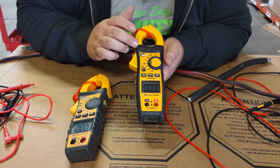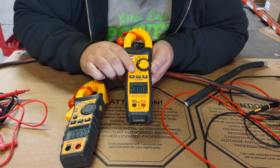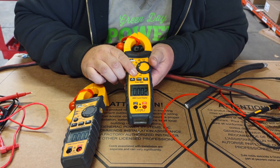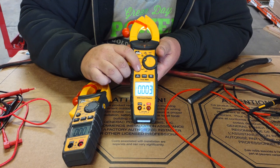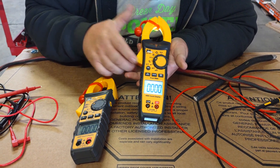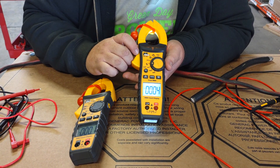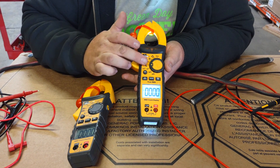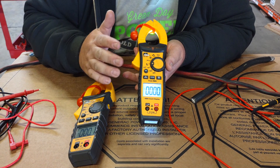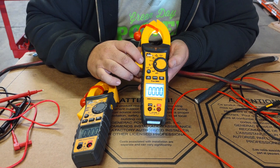On the 747, when you go to voltage, you actually have to select DC or AC using the select button. It says AC on the screen; you click it to switch to DC. I would have appreciated it just on the dial — I think that would have been a much easier way to do it. The meter also does hertz, so it will tell you the frequency of the item you're testing. If you're testing a generator, 60 hertz is what we use in America, so that's a really neat feature.